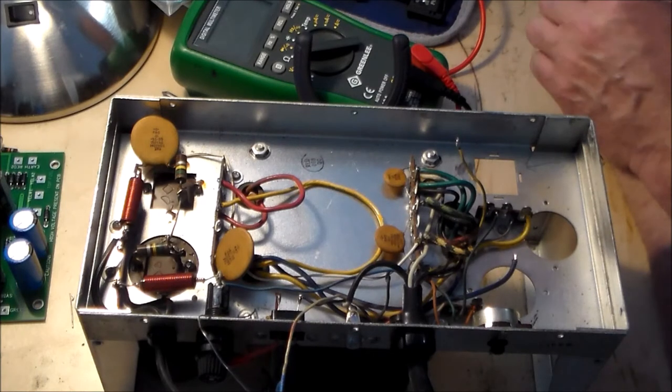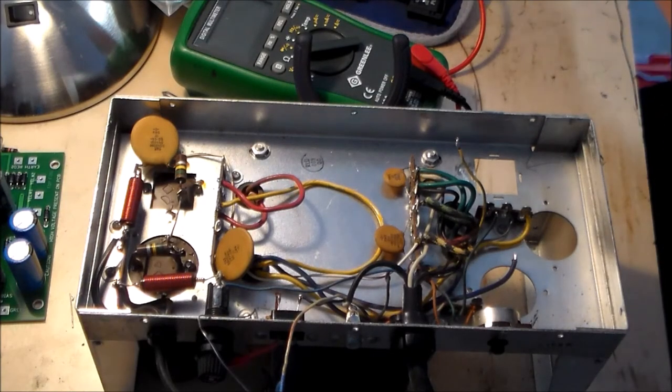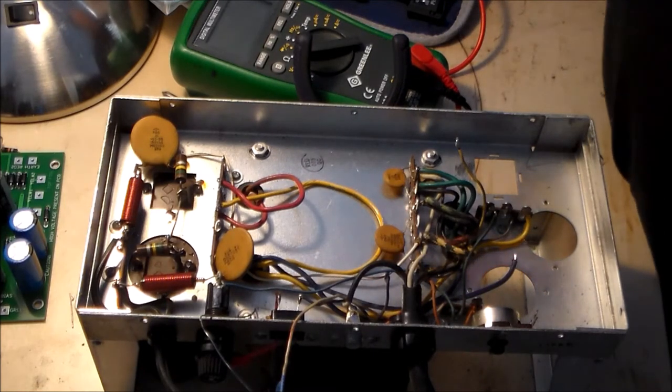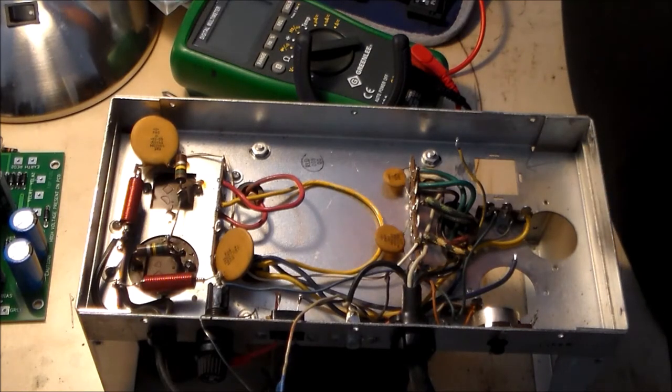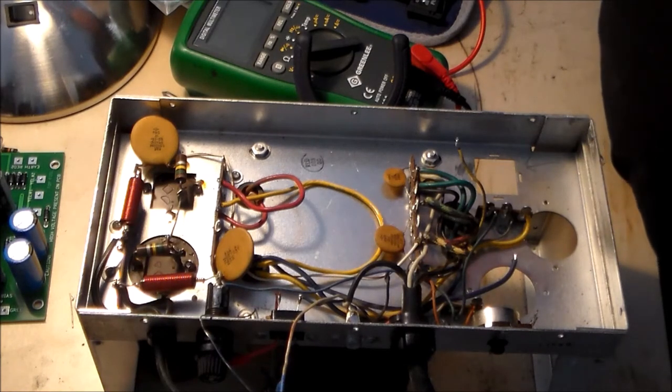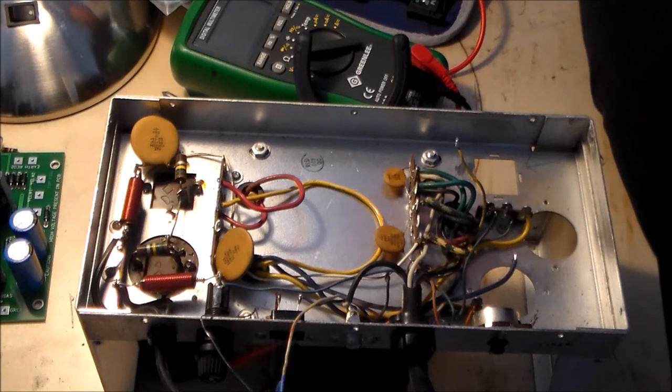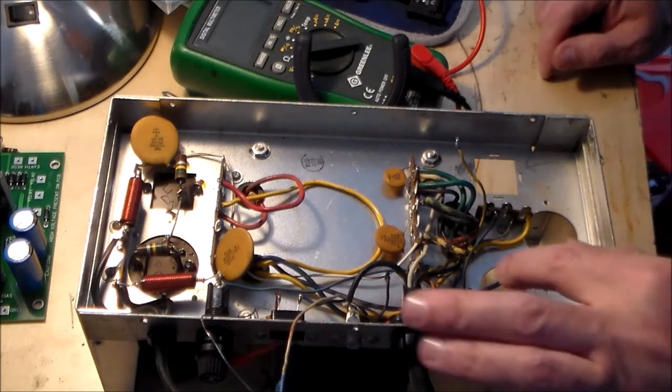Locate the PCB assembly you had laid aside before. Solder two blue wires and two yellow wires to the pads on the bottom of the PCB. Make sure you trim off any excess wire leads from the PCB. Hint: fold the yellow and blue wires into a single loop. Solder both ends into the pads on the PCB. Fish the two loops down into the old capacitor hole on the chassis.